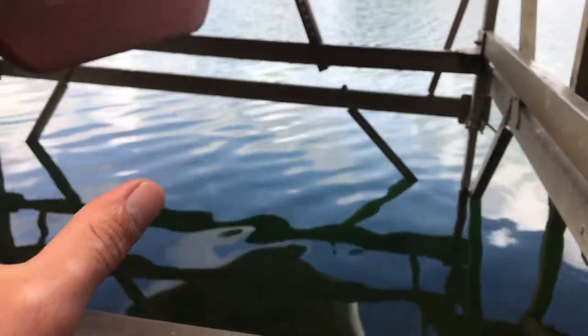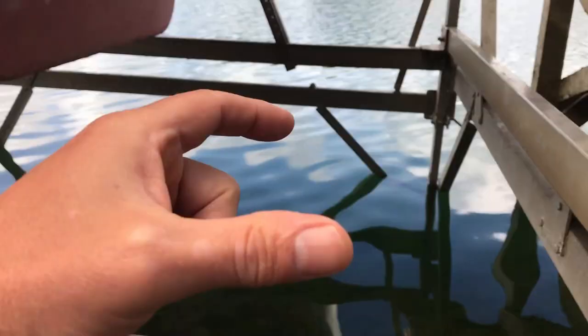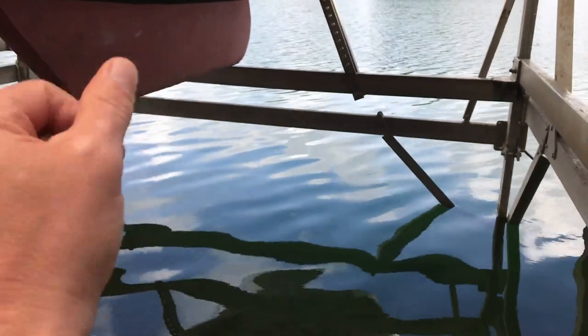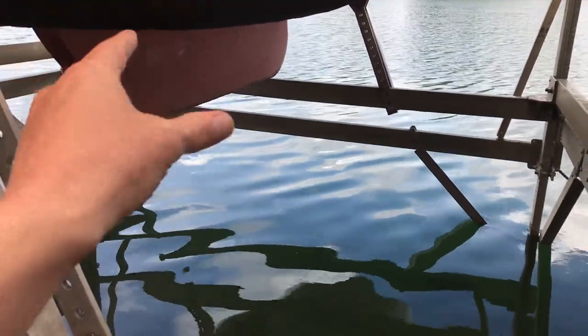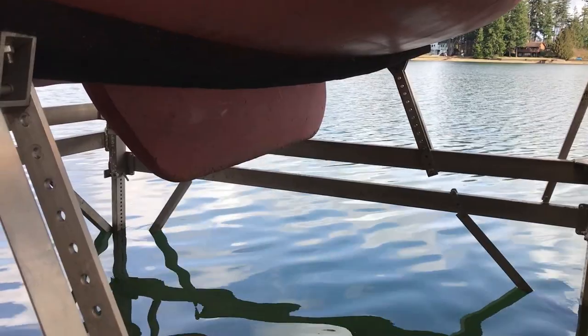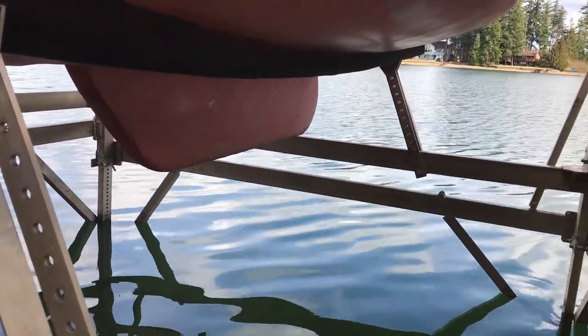Kind of putting a platform, okay, and then putting a cradle to hold this keel. Now this keel goes quite a bit up inside this, so it would be real easy for this keel to fall down side to side, and I don't want that. So I want to design something that's got a lot of lateral shear stiffness and strength. And I'll be underneath here, which is dangerous.